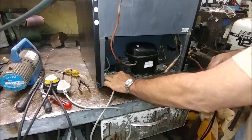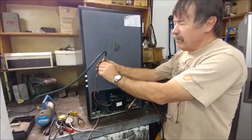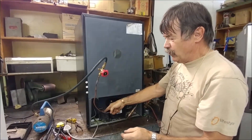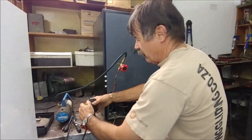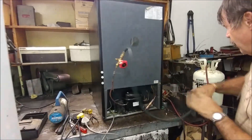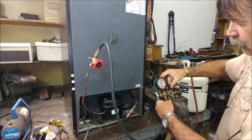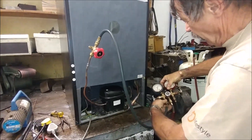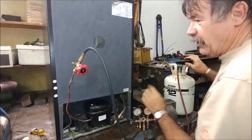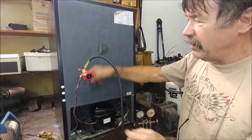There's also a little dust cover that covers the electrical connections which just clips on — nice and neat. After your two minutes of vacuum, first thing is you close the service valve to your compressor, then switch off the vacuum pump. We connect this onto our gauge and open our gas bottle so there's pressure, and we blow the air out of this part — we don't want air to go in.